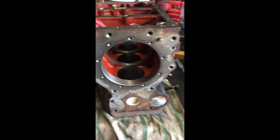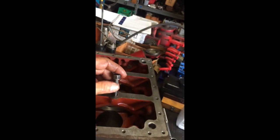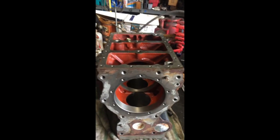But okay, moving on. All right, we're fixing to slide this crank in here. Usually you put the block on the table because they slide right in the back. This is the back of the block, and these slide in here, and then there's bolts right here that bolt into place, and you torque those bearing blocks. It makes the crank very strong.